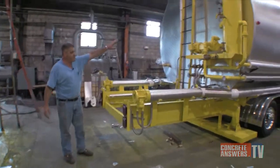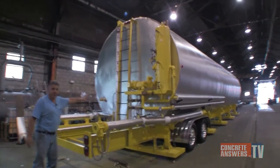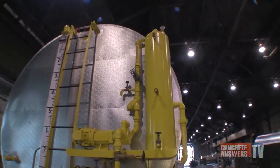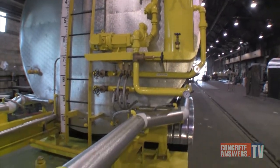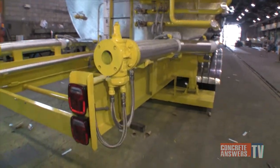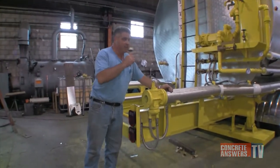We have a 40-gallon expansion tank with a Viking AK-495 circulation pump. What we're doing with this is we're able to heat the asphalt plant, the pipeline, and any other assorted pipelines and pumps that have to be heated — we heat the entire system. This entire unit is heated with the hot oil in the jacketed pipeline and a pump supplied by that circulation system.